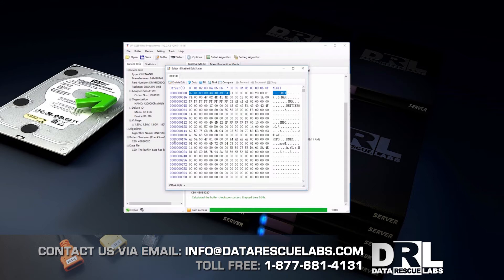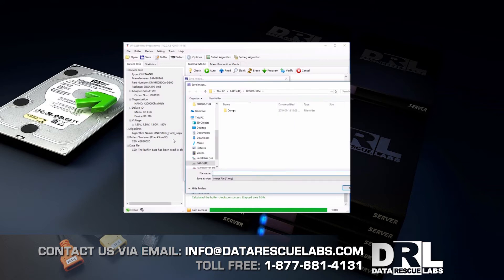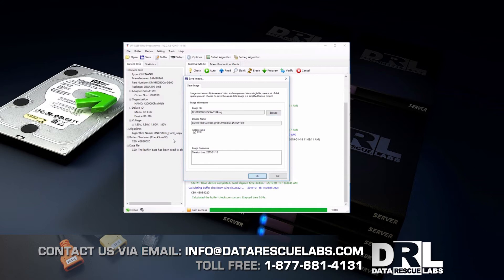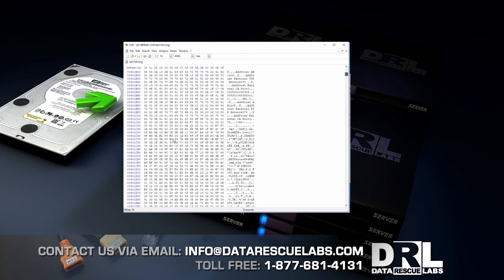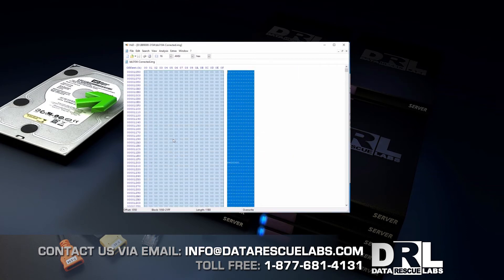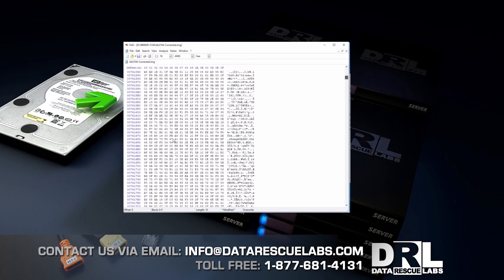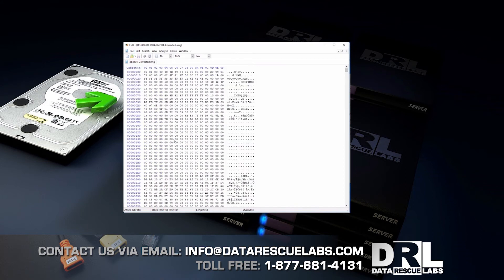Very important: at the very beginning of this chip it says HMIT, and that portion is extremely important. When I save a binary dump of this chip, that data will not be there, which causes all kinds of problems decoding the data later. I'm saving it now, and opening the chip in a hex viewer shows that beginning is missing — there's just extra garbage data the programmer saved. So I save a second copy, remove that entire garbage section from the binary data, and now the dump is exactly as it should be. I search for some message strings — I've blurred it out because it's personal data — but the data is in here.